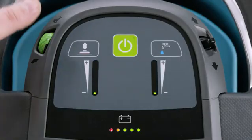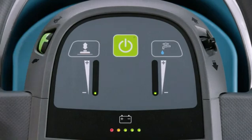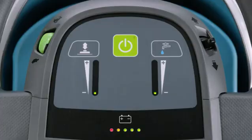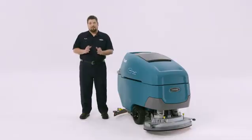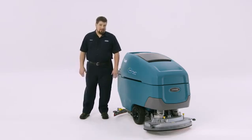The green dial on the left is the speed dial. All the way to the rabbit will increase your speed, and moving towards the turtle will decrease your speed. It's easy to remember because rabbits are typically faster than turtles when they aren't taking long breaks during foot races. The speed dial and forward and reverse toggle are the same on all machines.